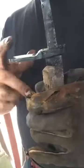So there we have it. One hot fitted and forged guard. Needs a bit of attention, it's a bit skew, but one more heat. We're going to cut it off about here and shape it on the grinder. A better smith than me will forge that to shape 100%. I guess I'm not clever enough to anticipate the growth of steel enough at this stage, so I'd like to have a bit more meat to work with and get it done right.